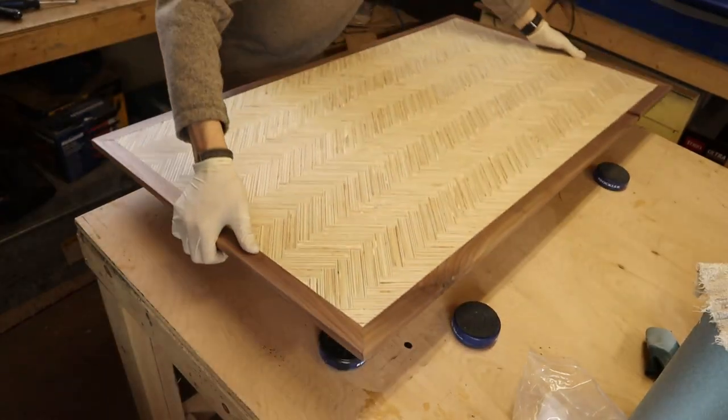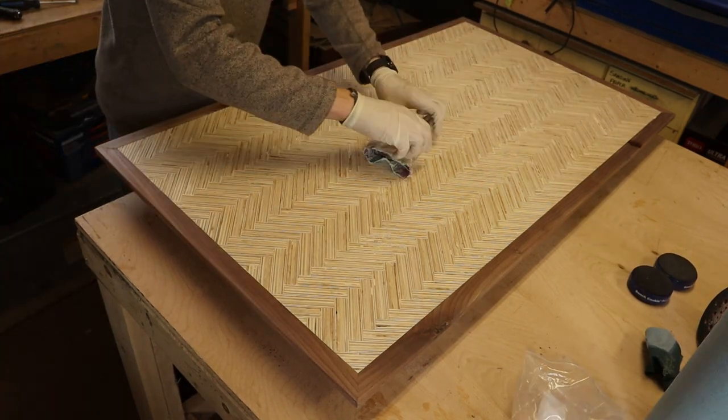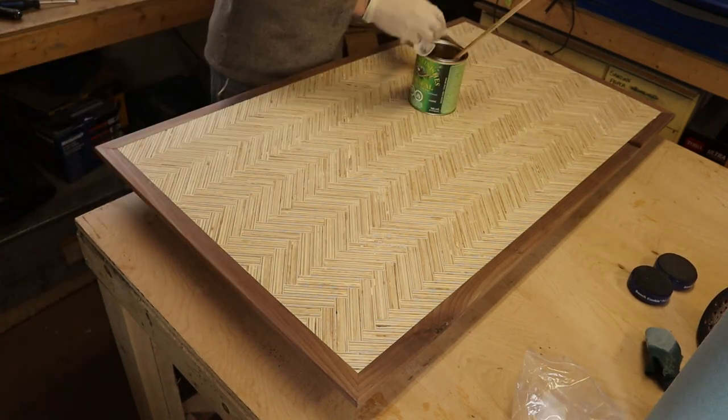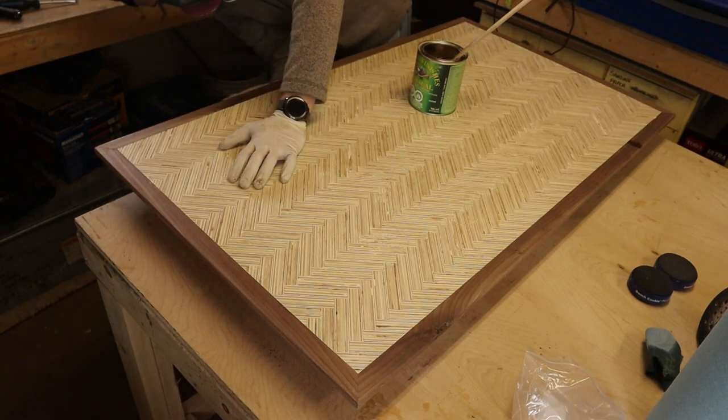After you spread oil over all the tabletop, you want to go back and wipe in the direction of the grain, but it's important not to apply too much pressure here or you'll get streaking. I then let the finish dry for at least 12 hours before lightly sanding with 320 grit and repeating the same process.